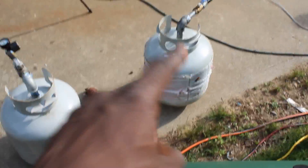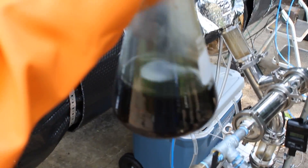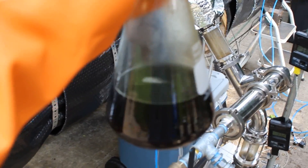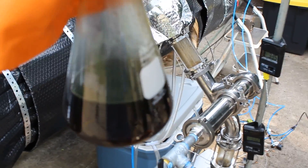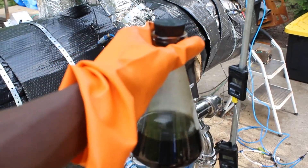I'm going to show you the carbon we got from the last run. The natural gas product ends up coming out - you've seen the oil product. The natural gas product can be collected into a bladder or compressed directly into tanks. I have some modified propane tanks here. The liquids that come down that chute are raw pyrolysis oil, essentially crude oil - a big range and mix of petrochemical products like gasoline, diesel, jet fuel, or maybe some other things in between. This is not ready to put directly into an engine; it needs to be distilled and refined.